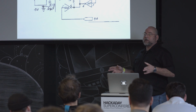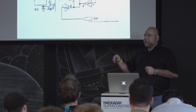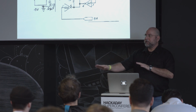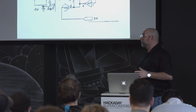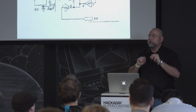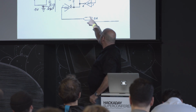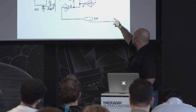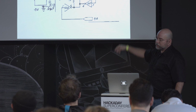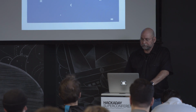So during this time also, when we're done with the PC board we've been working on for CES, we have 1 month to make changes to it, and then it's going to mass production. So I'm not allowed to move any chips, I'm not allowed to add any chips because I've already submitted to FCC and I'm not even done. The rule is I can move traces and I can add transistors. That's the only thing I can do. So we end up making a latch out of existing garbage. If you do the logic on this it will give you another ear bleed, right? But that's actually a latching circuit done with garbage on the board. I think we did this one by like 9 in the morning one day.